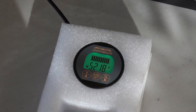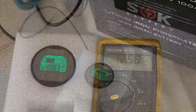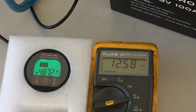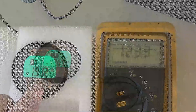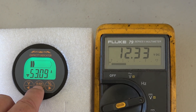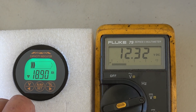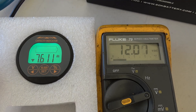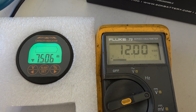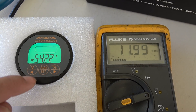We're going to pull up to around 52 amps and see how many amp hours we can get out of this battery at that current draw. We've just passed the 50 amp hour mark with 12.58 volts on the terminals. Right around 19 amp hours left, still drawing over 50 amps — 53 amps right now — and the battery posts measure 12.32 volts. Getting down near the end, we're down to 12 volts on the battery terminals and 7.4 percent remaining, still putting out 54 amps.